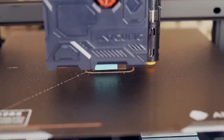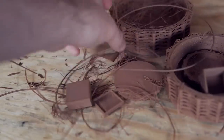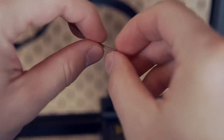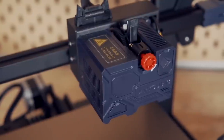Wood filled filament is probably the most clog-prone material I have ever used, even more so than carbon fiber nylons or other abrasive materials. I spent quite a long time trying to dial in a 0.4mm nozzle profile but ended up swapping to a 0.6mm brass nozzle. I would definitely recommend going with at least a 0.6mm nozzle to avoid dealing with clogs nonstop. Considering how aggressively brittle this material is, the Cobra's direct drive extruder was incredibly helpful — having a very short filament path makes a big difference, and I'd absolutely opt for direct drive over Bowden for this material.